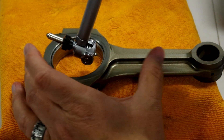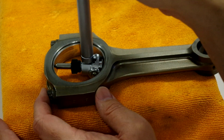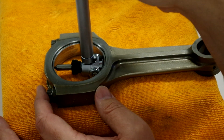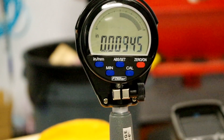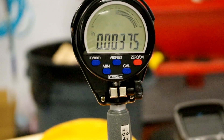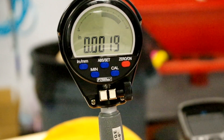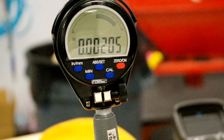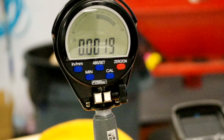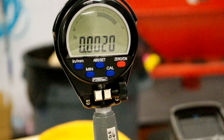Here's the rod — you can insert the tool like this. It has a little spring load, and you can rotate it back and forth to find the minimum distance. I'll aim it so you can see the readout. We have the bore gauge inside the bearing surface and we tilt it to find the smallest number, which represents that minimum distance. Right near the center of the bearing, the smallest distance is about 1.9 thousandths. Moving up to the outer edge of the bearing, the clearance is similar — about 1.9 thousandths.